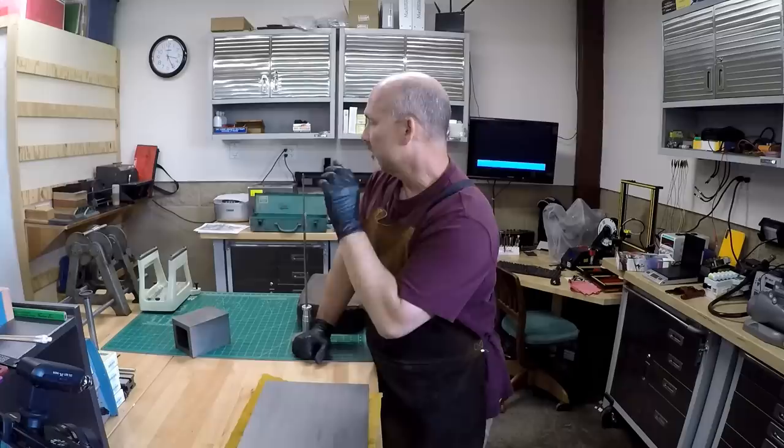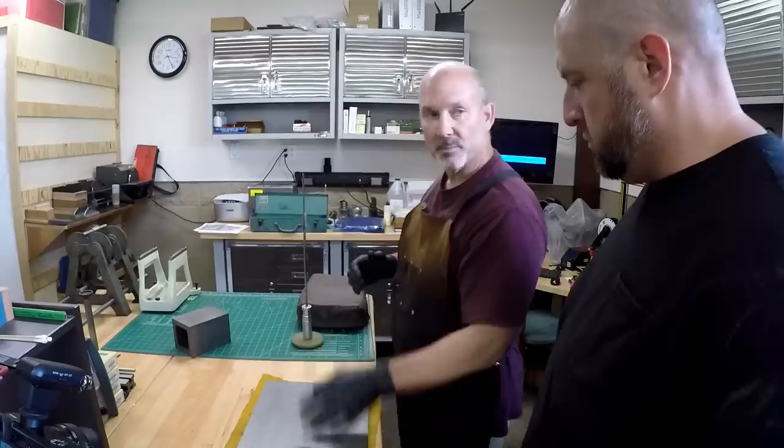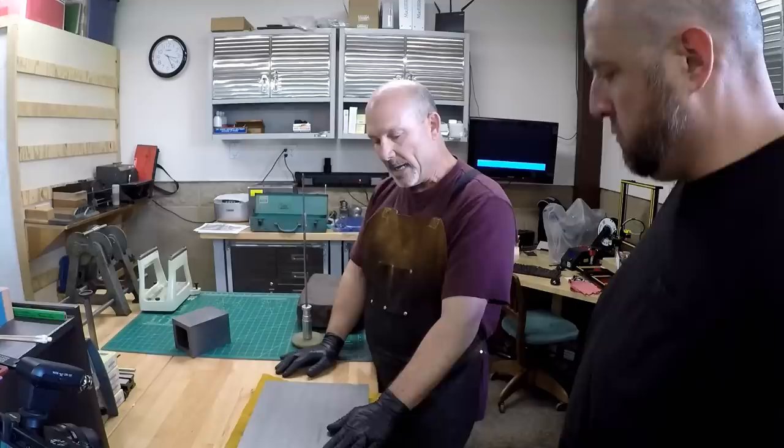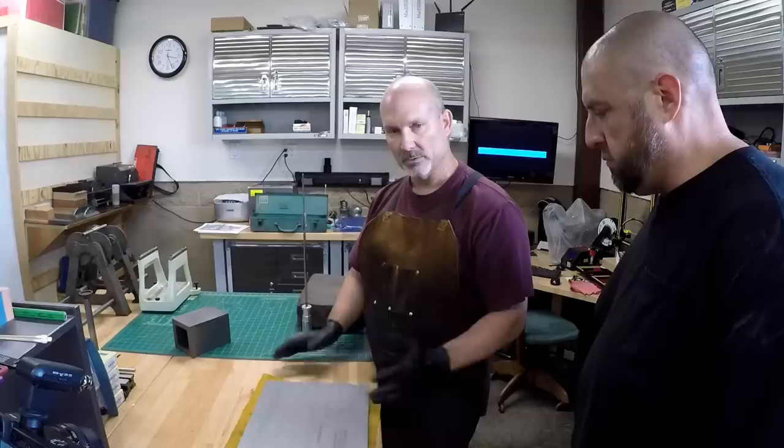I don't know if those straight edges are probably not in the view, but we'll show them so they'll see. Right. So whether you're bringing the part to a granite to do your testing, or whether you're bringing a reference that has been mastered to a granite to your part, you can get them incredibly flat. That's really the short story. And then in cases where you have movement, you have that pocketing, and then you can get oil in those pockets. I mean, that and the longevity is excellent.